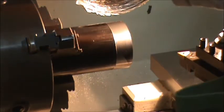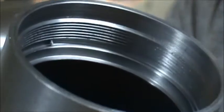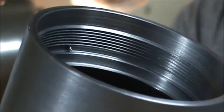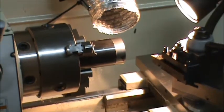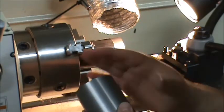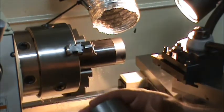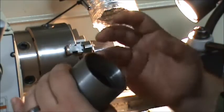Hello YouTube, SWLAMEC84 again. I've done a little bit of work on my tubes — I've got my threads cut and my connection made on one side. I'm running this on my three-jaw chuck because I have all my pieces cut to rough length, so I just need to come back and take a couple thousandths off each side until I get my exact length. They're just rough pipe; I'm going to bore through them and turn the outside up.